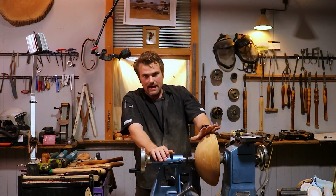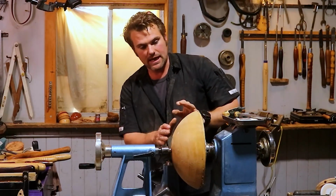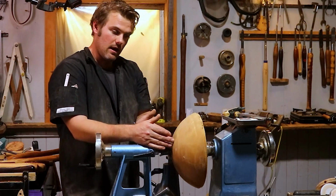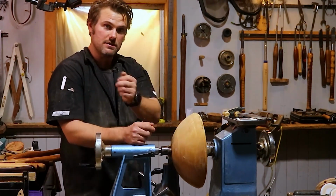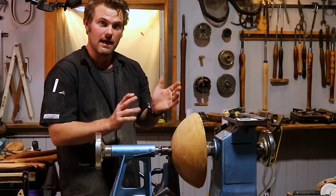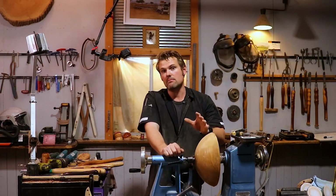Right, so that is a sure way you can shape up the outside real quick. Just take a little trim off to make it run true, and then come around and mark up your tenon with your dividers or the Glenn Lucas tenon sizing indicator that sits on your cup center. So that there is the chuck or faceplate method for remounting your bowls.